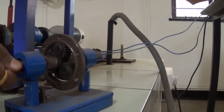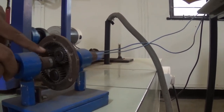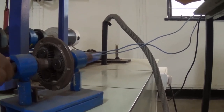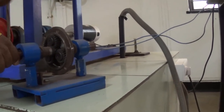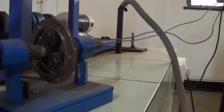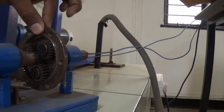As we are giving the input torque, you can see here, this is the input torque. We are getting output somewhere here, and our annular gear is rotating. If you allow this annular gear to rotate, the entire assembly is going to rotate. So that is not needed. What we want to do here is hold this particular outer annular gear.